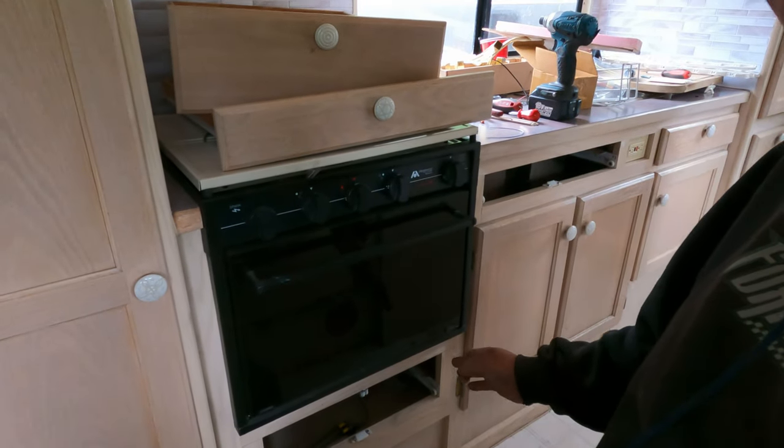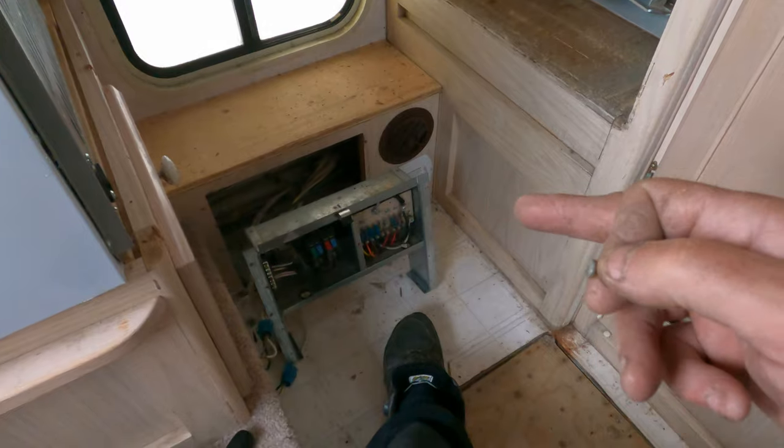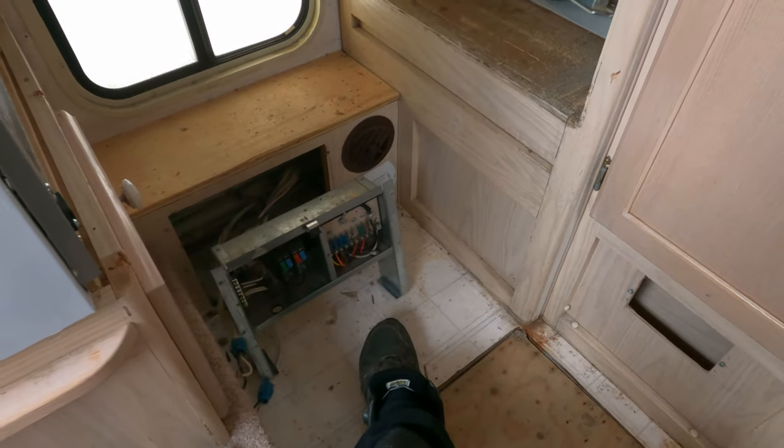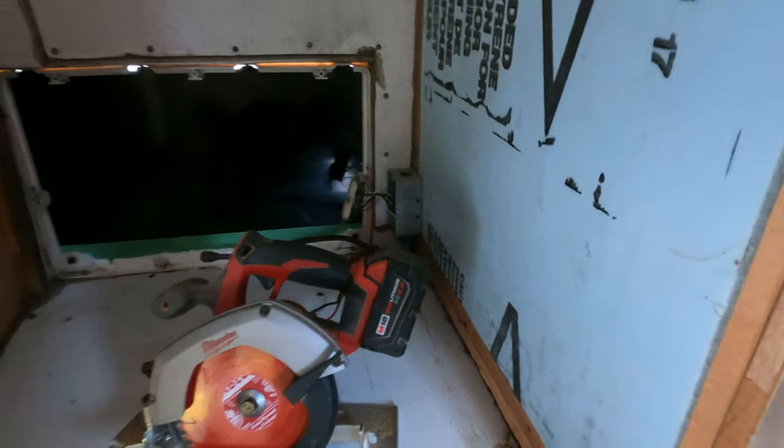The wire that was coiled under the stove is a 10 gauge wire. You'd assume there would be a 10 gauge wire going into the breaker panel from that direction, but they're all 14 gauge wires. My intention was to uncoil that and run it over to my inverter as my 120 volt feed to my panel. Now I'm wondering where it goes and if it connects to something along the way — I can see it going under the fridge cabinet, but then I don't see it. All the wires that come in are 14 gauge, not 10 gauge.